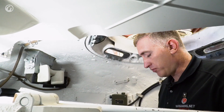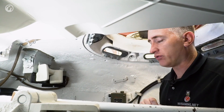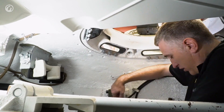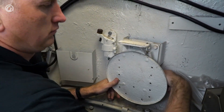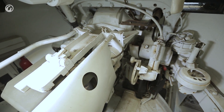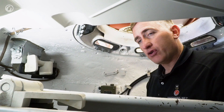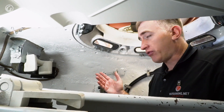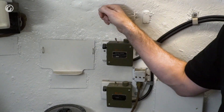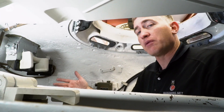Now inside, where the commander sits, I'm on a fold-down seat with a simple lift-latch. It is cozy — the breech recoil guard is taking up a lot of space, and I've had to place one leg on either side of the gunner's seat. The commander has an override handle: push forward for left, back for right. It's a simple physical cable that goes down and moves the gunner's control handle, which then moves the rest of the system — very useful for getting the gunner onto a target quickly.